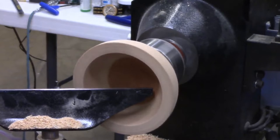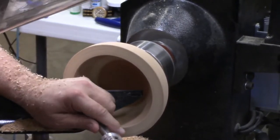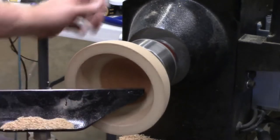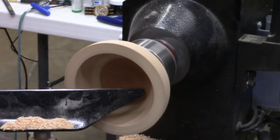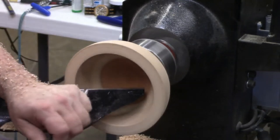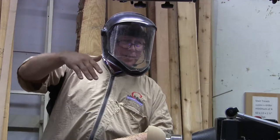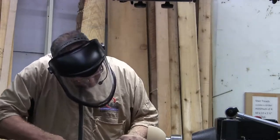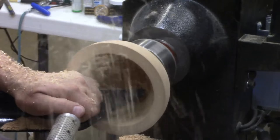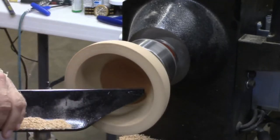But I brought a small blank, because I really wasn't sure which lathe you guys had tonight. And I brought this gouge. I'm gonna get some more in there. Okay, so I can go as far as I can, because one of the big things I want in my bowl is a nice, smooth curve. One of my pet peeves is when you take your fingers down that and you hit a ridge, keep going around, hit another ridge. That tells me the guy used this tool, or girl, this tool all the way through, and then they scraped along the bottom like this. And you can go a long ways by just turning the angle of the tool. But now I'm getting in a dangerous position with the tool, so I just take and change it.